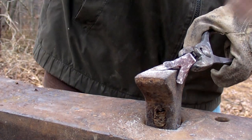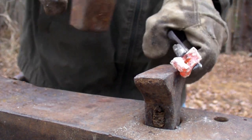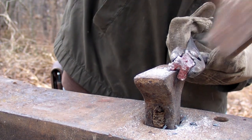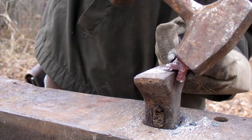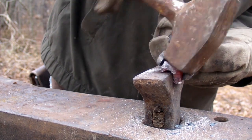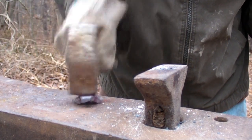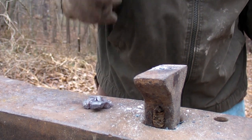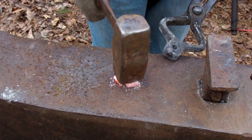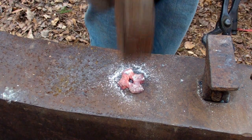Finally, I started to make some headway, and sometimes it even looked like I knew what I was doing. I started to wedge open the cut on the other side, and the arms of the cross unfold. The cross finally starts to take shape as it's now opened up. I also managed to find a nice set of tongs that helped immensely when it came to finalizing the shape of the cross. Sometimes it's all about using the right tools for the job.